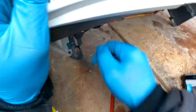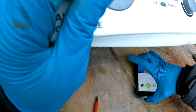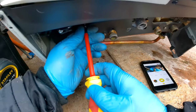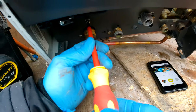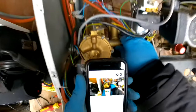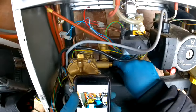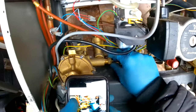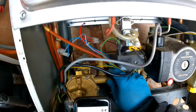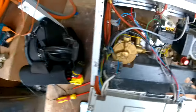I put it back in the same place first just so I know the diverter is in the right position. Once that connection is in it shouldn't be able to come out. Then pop the pressure gauge back in — make sure the washer is on there.